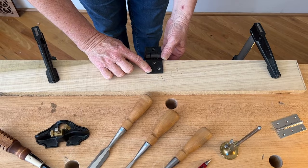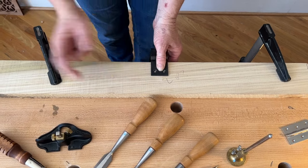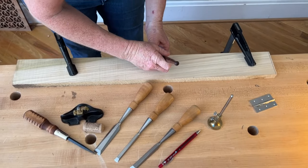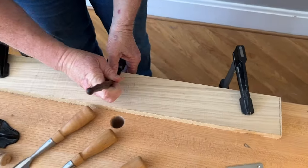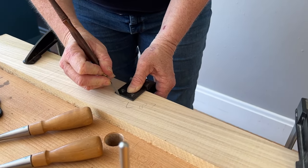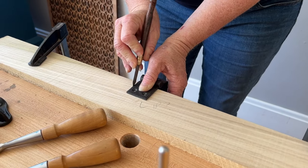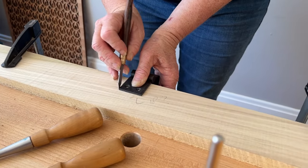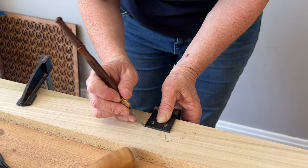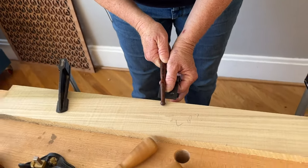I always start when installing these just with the leaf aligned so that it is on the edge of that rail, and now I'm going to trace around it with a marking knife. I have to hold it really tightly in place — I don't want it to move on me. Each hinge is designated for its own mortise because, as I mentioned, they're not interchangeable. I've got it all marked out; now I'm going to chase those lines with my pencil so I can see them better.